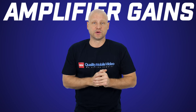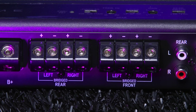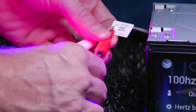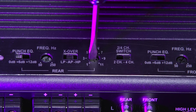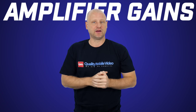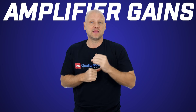Why is clipping important? Clipping comes into play in two places in our audio system, our speaker level amplifier and our preamp level amplifier. This is hugely important when we set the gains of our amp. We want to match the maximum output of the preamp level to the maximum speaker output of the amplifier. This ensures the best audio quality from both the radio and the amplifier.